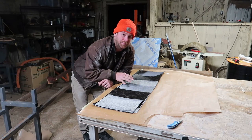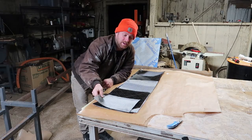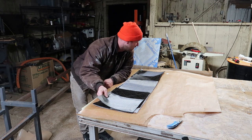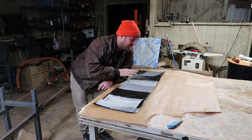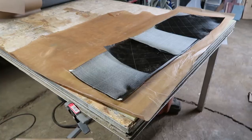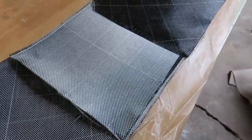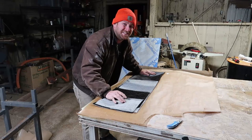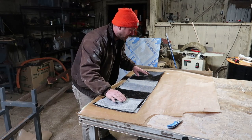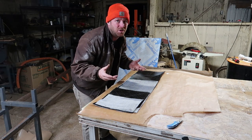I've cut five pieces of carbon fiber, about a yard each. I have 120 yards to spare — hopefully that's enough for this project; if not I have another 120 I can purchase, though it's a little expensive. I'm laying up five sections with alternating strand patterns: one with strands going straight, one at 45 degrees, one at 90, one at the opposite 45, and a fifth back to the first direction. The point is to see how stiff it gets as I increase the layers. I'll throw some peel ply over the top, let it sit a couple of days, then test how strong it is and how many plies I actually need.